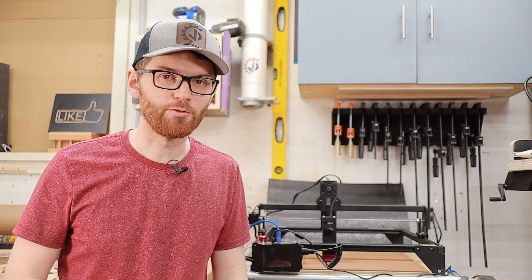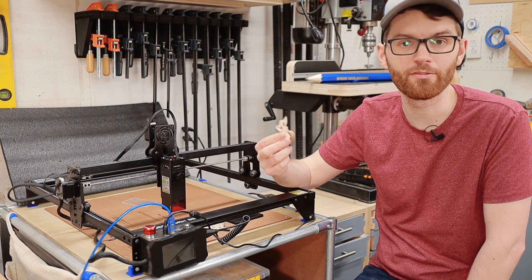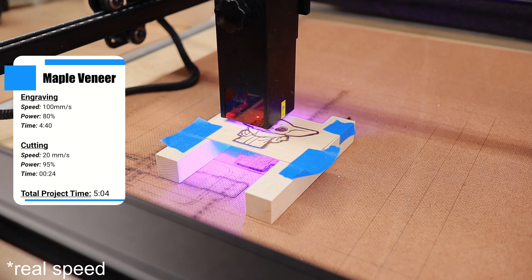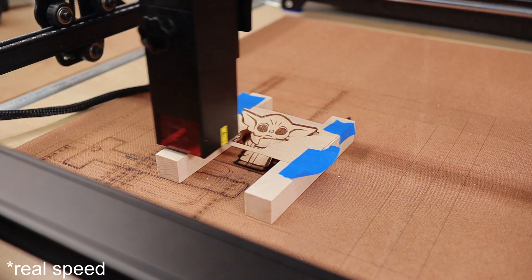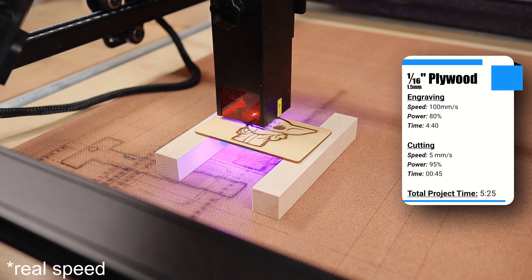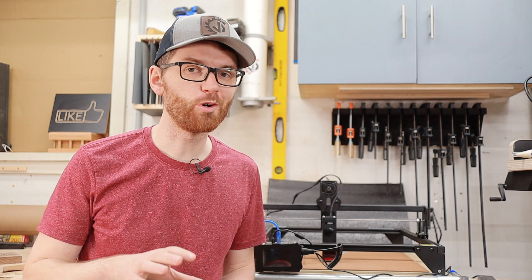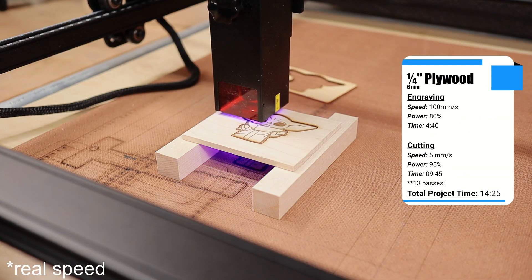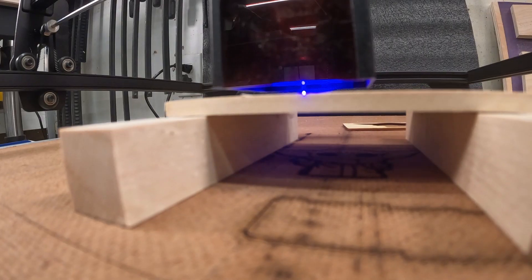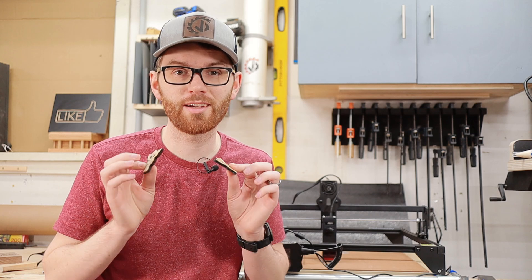Now for what you've all been waiting for — what can we actually cut with this laser? A 1/32nd inch thick veneer, measuring around 20 thou or 0.5mm, cut in two passes with a total of 24 seconds. Next, a 1/16th inch or 1.5mm thick basswood plywood cut in one pass running 5mm per second at 95% power — by far the best looking part I was able to cut. I also tested quarter-inch thick material on plywood and solid hardwood samples, both run at 5mm per second at 95% power, taking 13 passes — nearly 10 minutes per part plus engraving. These edges were super charred and I would definitely not recommend cutting materials this thick unless you plan to do a lot of sanding.